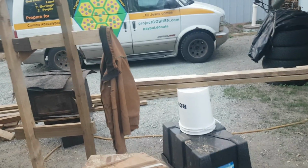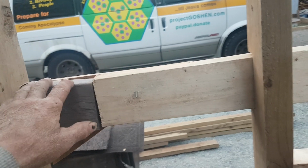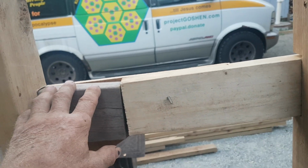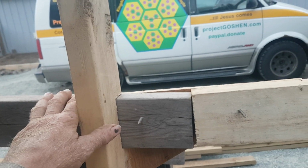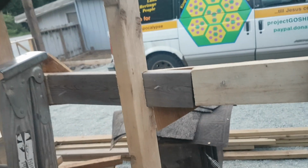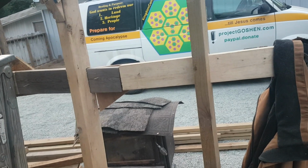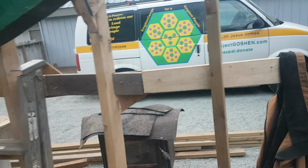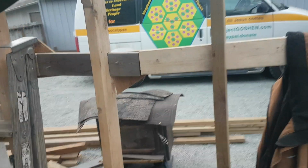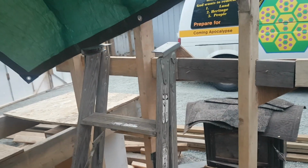What the beauty about it on your purlins, you could router for 16-inch centers, and also router for 24-inch centers, and router for 32-inch centers. And you know, for a shop, 32-inch centers would work. And that expands it from being 12 feet right up to 24 foot just by doubling the distance here. So I think I got a winner here.